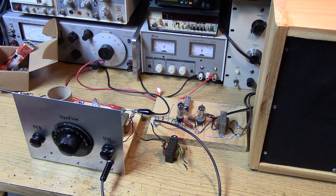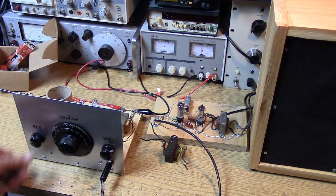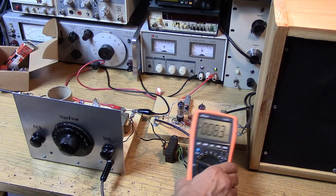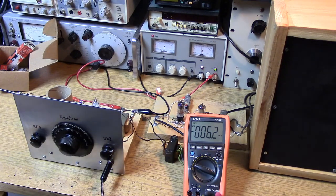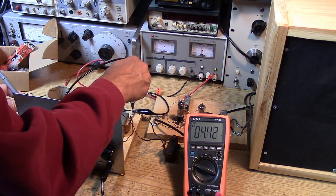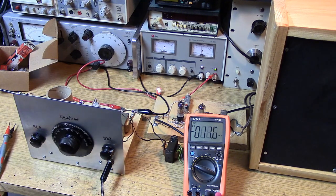It's a little bit bright, but not bad. So this is an example of a small power transformer that I'm using as a choke. Now, with a choke and with such low resistance compared to using a 27K or 47K resistor in place of the choke, you would expect that the voltage required to reach regeneration would be quite low. Let's see how low for this tube. I'm going to measure the center of the pot which is feeding the voltage to the tube. It's reading 4.47 — about 4.5 volts. At 4.5 volts, that tube is oscillating. It's absolutely amazing.